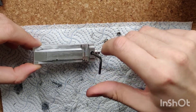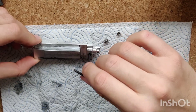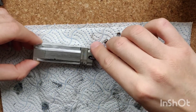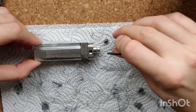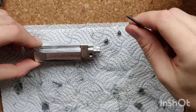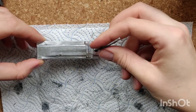So that's the 8mm one in there now, and it's much more solid in the hole. If you're using it closer to minimum power, you'd be able to put a couple of turns on that. Especially if you've got a longer barrel in your gun, you're going to want to reduce the power more, so you'd want the screw wound further down into the nozzle, and then you'd be able to put the locking grub down on top of that.